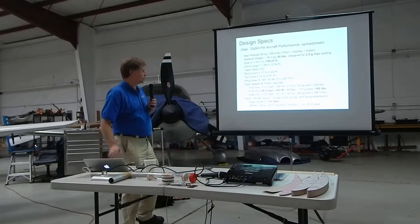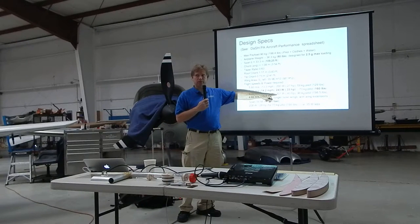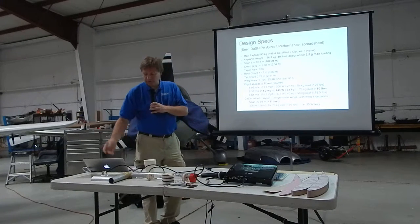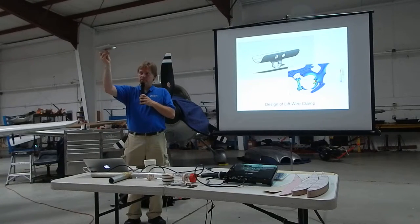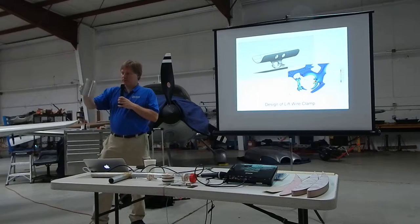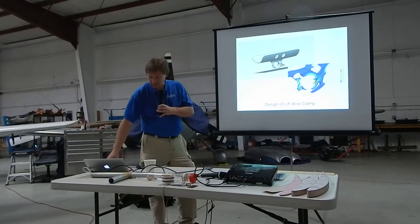Our goal was 80 pounds, and at that weight the heaviest pilot — about 200 pounds — should have used about 300 watts. But now we're up to around 330 watts because we came out at 100 pounds instead of 80. When we put the wingtip extensions back on, that brings most of that wasted power back. This is a picture of one of the clamps that gets glued onto the wing spar in the middle of each semi-span — this is what the lift wire attaches to, latched onto the wing with a bunch of Kevlar. It's a fun-looking four-axis-mill machined part. The reason it has those big wings on the side is that we didn't do any extra reinforcement on the spar itself, so we wanted to make sure we distributed the load well and didn't buckle the spar.